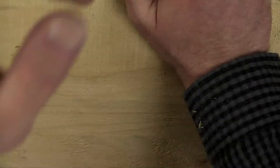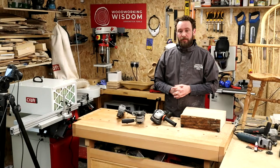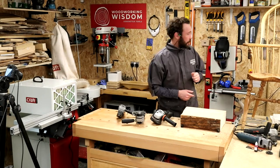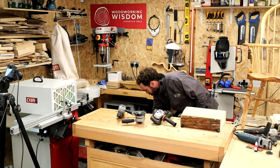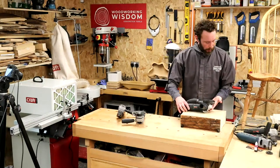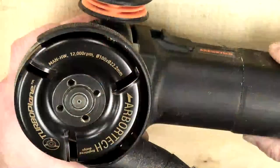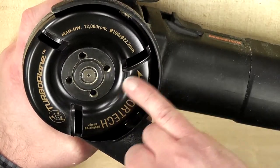All right. Okay. So I've got a question here from Hodgepodge. He's asked, can the discs be sharpened or are they intended to be replaced? Yep, so certain ones. Sorry, I've left my helmet on there. The turboplane, let me just unplug the grinder. So this wide tungsten tooth, we come on camera three there, this wide tungsten tooth is resharpenable.